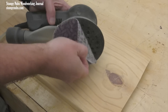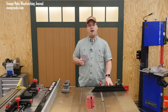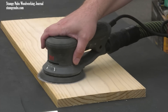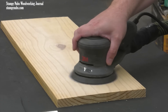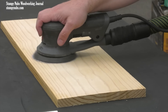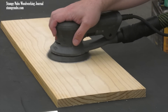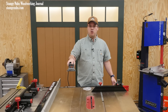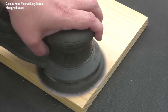So how do you know when it's time to change your sanding disc, sanding belt, or sandpaper? Well it starts with how it feels as you use it. When the disc is new, take note of how it feels when you move your sander across the surface — note how it bites into the wood, and notice the torque of the tool as it tries to turn in your grip. As the paper wears, you'll feel those things begin to diminish, and eventually the sander will feel like it's skating and sliding around without biting in much. You'll also notice a decrease in the speed at which the paper is cutting — perhaps when you started you were removing marks and scratches in one or two light passes, but over time it begins to take four or five passes to get those same results.